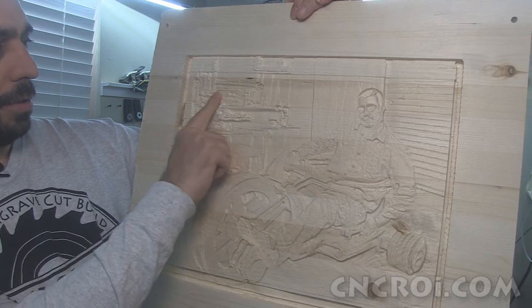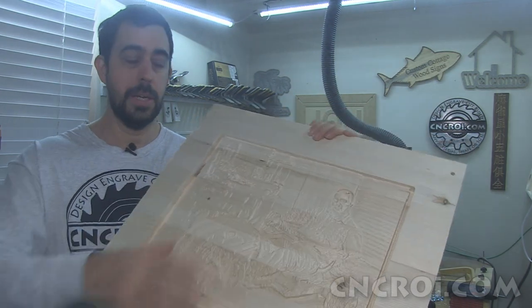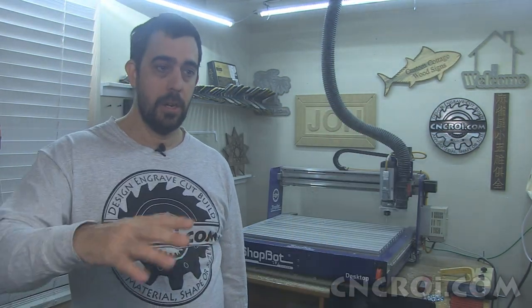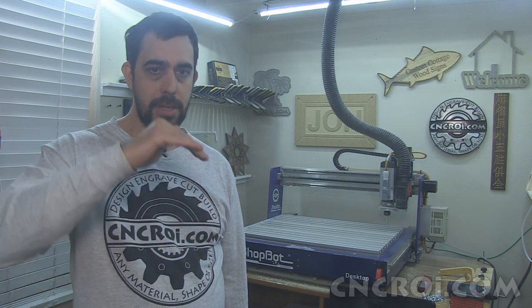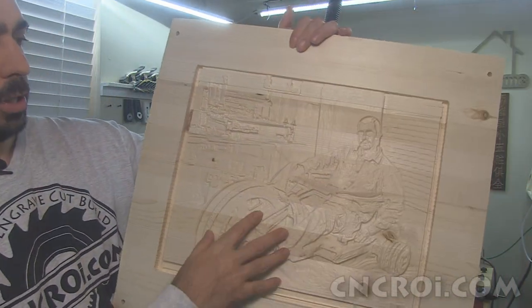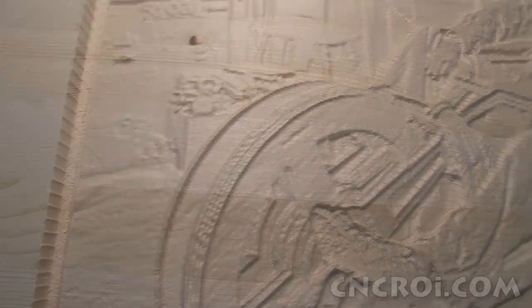There's a little bit of fuzziness here and there that I'll fix up before I do the staining. The reason for doing the staining is because what you want is some pooling in the valleys and almost sanding off where it's at the peaks — and that produces a lot of contrast. For this project here, I'll just use a cherry stain. As you can see straight up, you can see a lot of really nice detail on this.